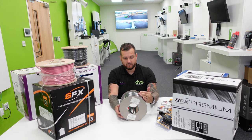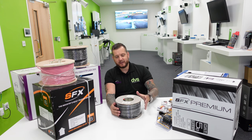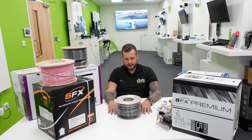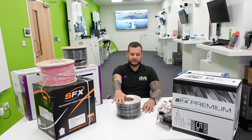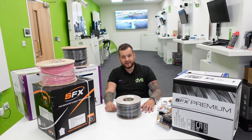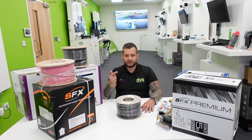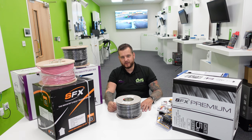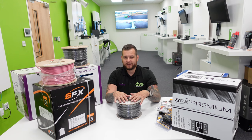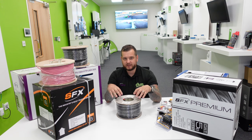This RG-59 comes on cardboard reels — this is a 100-meter drum. This is a premium CCA, copper clad aluminium. It's not like the tin equivalents you can find online from grey market dealers. Yes, it'll be cheaper than what we supply, but it won't be copper clad aluminium — it'll be tin. We've all been to an installation where the distance won't go as far as needed, the image is poor quality or dropping out. That's because the cable being used is generally poor quality. Lots of tin and aluminium-without-copper variants are on the market — that's not what we do. We're professionals and we use the CCA version.